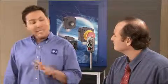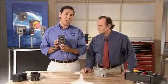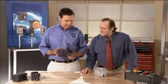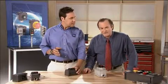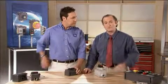Well, Jim, the first innovation was the move to factory-sealed control stations. With older generations of control stations, you needed to have conduit seals. Now, those are very expensive, very time-consuming fittings, and you needed to install them within 18 inches of the station itself. Today, control stations like this one from STAHL don't require a seal. Yeah, I get that. Factory sealed is definitely the way to go. For me, it saves material and labor with minimal additional cost.